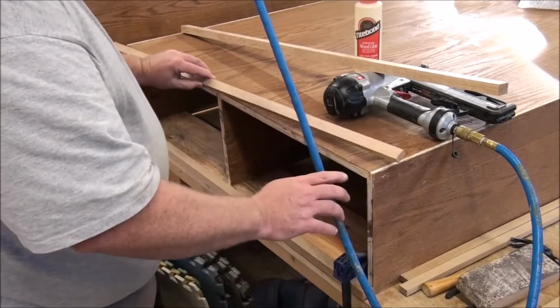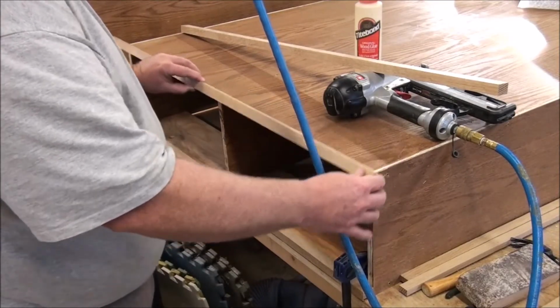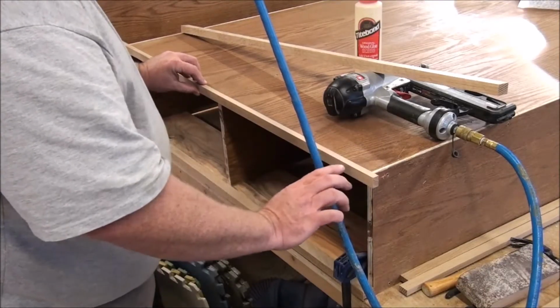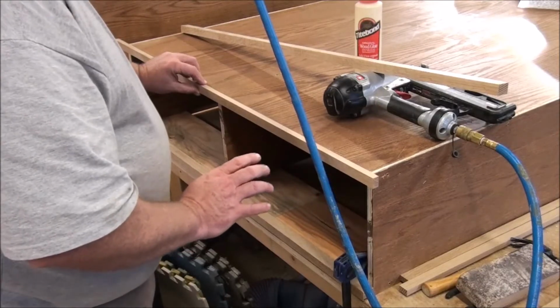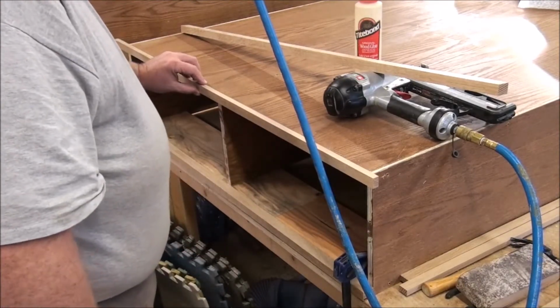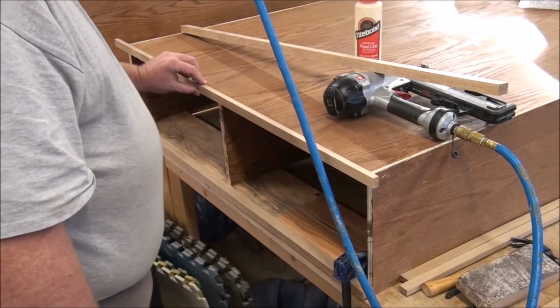And we've used the little nail trick. We put a little nail, cut the top off it, and that helps a lot, for sure. So you've got to line your trim up, then you have to get your caul in place, and you have to get your big heavy clamp in place, and then you have to get everything tightened up. And that is just too many ifs, too many variables for my comfort.